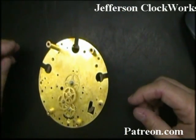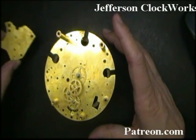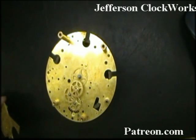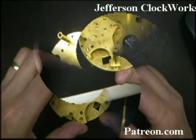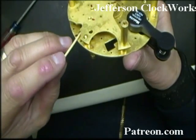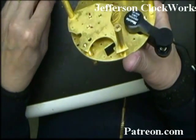We're back from the cleaning and polishing of all the pivots. I didn't find any pivots in bad condition. The first thing I'd like to do is check out all the bushings — the ones between the subplate and the front plate. I put the four wheels in there for the time assembly. I hooked up my TimeTrax audio amplifier to it just so I could hear the shake. We got shake there, shake there, shake there. I don't think we have any shake there.